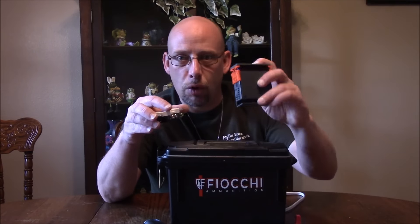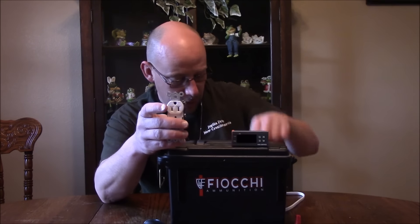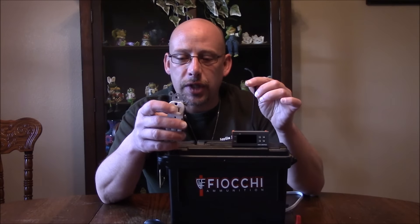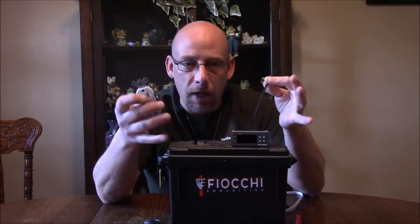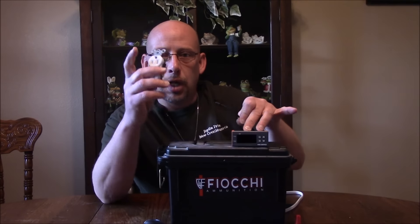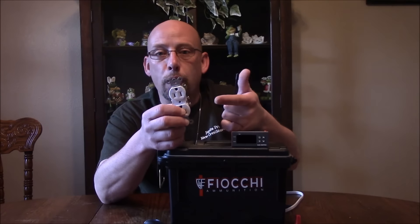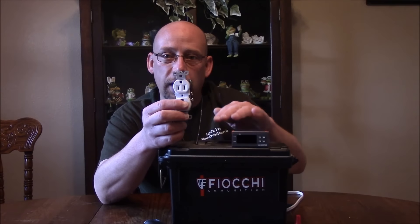What I'm going to do is hook up this controller into this box and put this receptacle in here. One side of this receptacle — if I plug a heat lamp into that and run this remote probe — I can maintain a certain temperature, like in a brooder box for some quail. If you're a home brewer, a lot of guys use these for kegerators. You can use it to build incubators, fermentation cases out of a cooler — just run a wire, set the temperature you want, it'll turn a heat lamp on and keep it warm. The other side of this receptacle could be used to run a fan or a compressor to keep something cold, like when you're storing quail eggs or chicken eggs and want to keep them at a certain temperature — run fans based on temperature when it gets above a certain point.